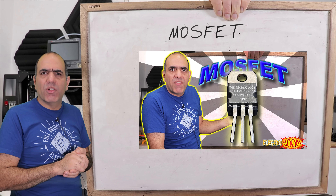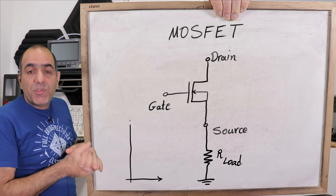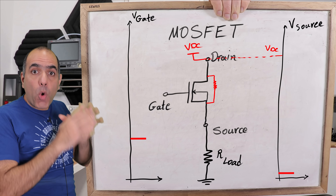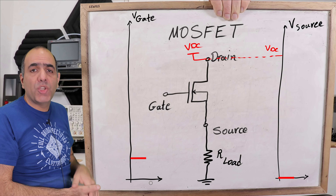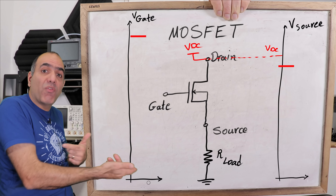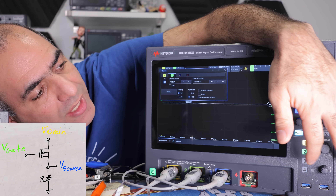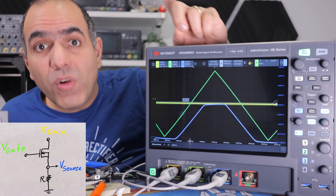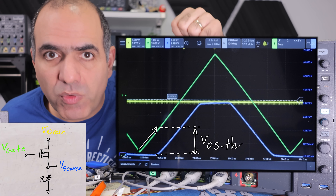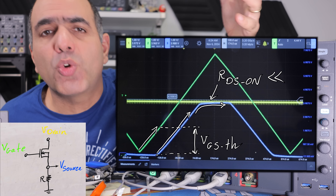All you need is a MOSFET. Basically it is like a resistor when it's on — the higher the gate-source voltage, the lower the resistance. Raising the gate voltage reduces the drain-source resistance, opening the floodgates for more current through the load and raising the load voltage. Reducing the gate voltage drops the load voltage. So tuning the gate, we can tune the load between zero and the battery voltage maximum. Here I have a MOSFET with four volts DC on the drain — the yellow line — and I supply a triangular wave on the gate between zero to eight volts, the green line. The source voltage, in blue, only rises when the gate voltage exceeds the MOSFET threshold voltage, up to the four-volt drain voltage when drain-source resistance is very small.